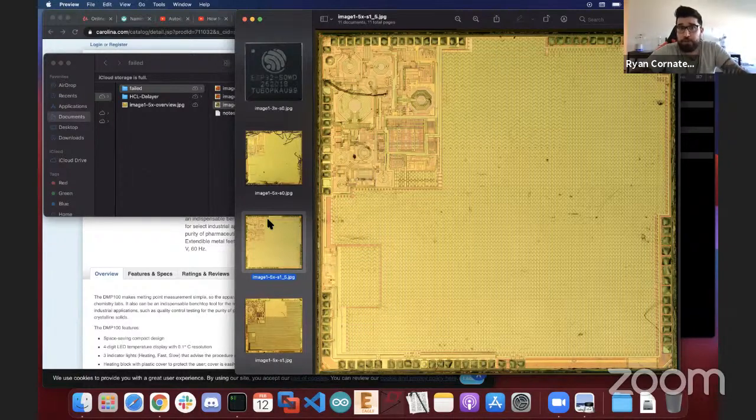So basically what the formula would be is, since I was using 3% concentration hydrofluoric acid, I would dip in hydrofluoric acid for 15 minutes, take it out, wash it with water thoroughly to make sure there's no more hydrofluoric acid residue sitting on the chip, because we are then going to mix 50-50 of hydrochloric acid and hydrogen peroxide, which once you introduce copper into that mixture, creates something called copper 2 chloride. And that happens if you start to see a greenish color inside of your solution, which I did start to see. I started to see that greenish color start to come out, which means you've successfully made copper 2 chloride.